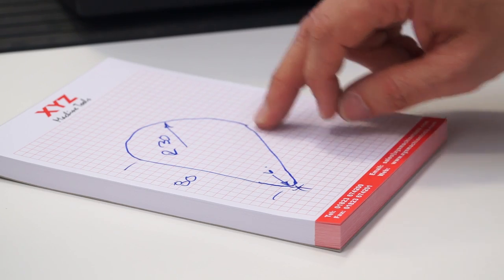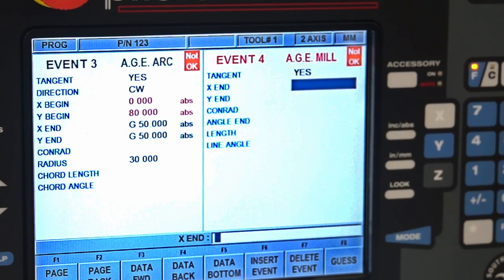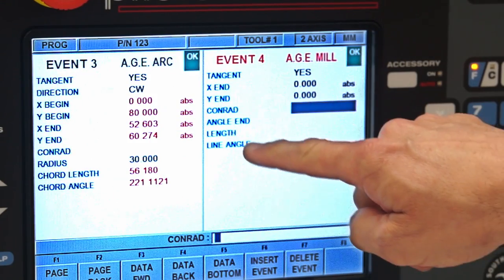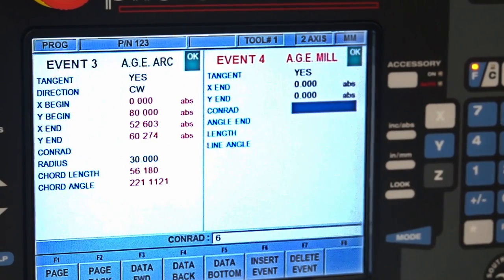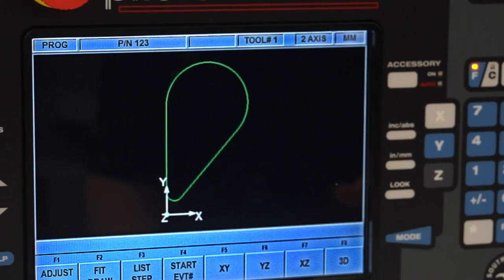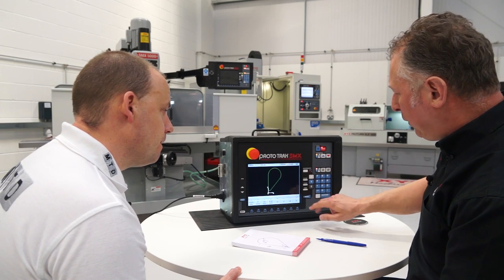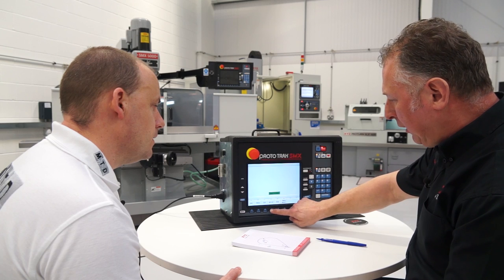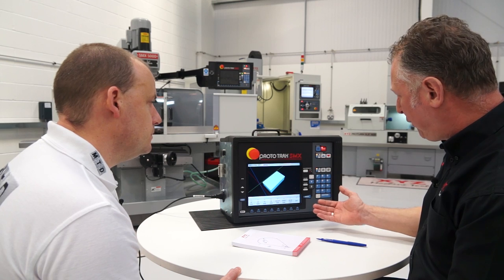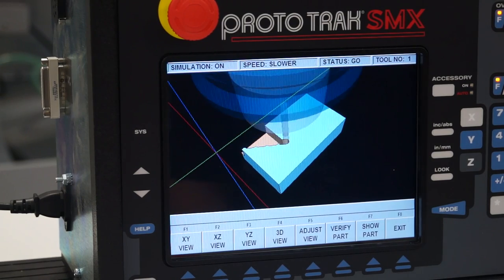We page forward to mill the straight line — 1 is tangential, and we're going to end at 0, 0. It's all gone OK and it's filled in the dimensions we didn't know. I'm also going to put a corner radius of 6 millimeters, and to prove that's exactly what we wanted, we have the drawing of the job. The finished part is programmed in two minutes. If we want to see how we actually machine it, we verify the part, say 'make that part,' get a 3D graphical image, slow it down a little, and you will see it come in and machine the part.